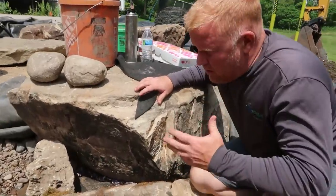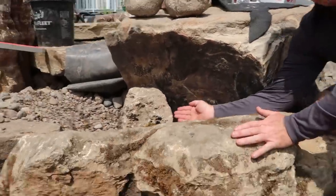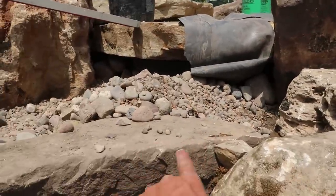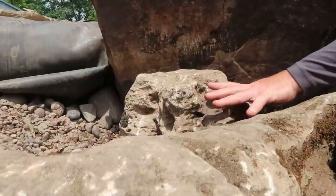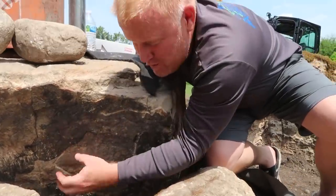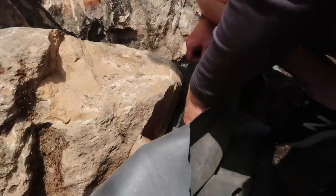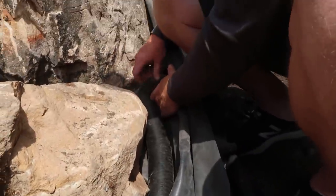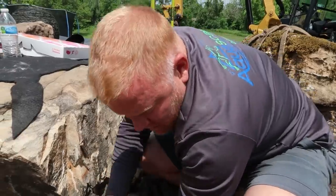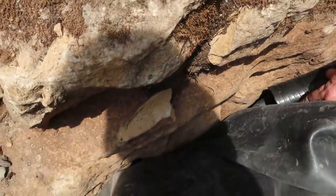The main thing we did here was put a rock in by foaming underneath it and sealing it, so minimal water ever comes through from this spillstone. It was really important that this was higher than that, minimizing how much water comes through — now it's just drip, drip, dripping. You can actually put an aquatic plant in here and it'll look great. We sealed up underneath and the key thing is we put this pipe in here. As long as we leave this as gravel and put gravel over the top, even if the gravel gets clogged, we still have this chase where water can get all the way back in.